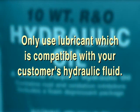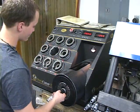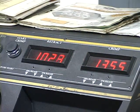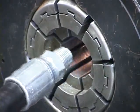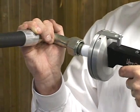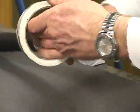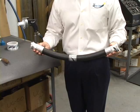Use lubricants sparingly and start above the end of the stem. The crimping or swaging process causes stem collapse to achieve the proper coupling retention. Internal metal flash contamination will occur and it must be removed. A third and final projectile must be fired through the entire assembly to finish the cleaning procedure. You should now use either ultra-clean tape or clean caps or plugs to ensure the assembly stays clean and contamination-free.